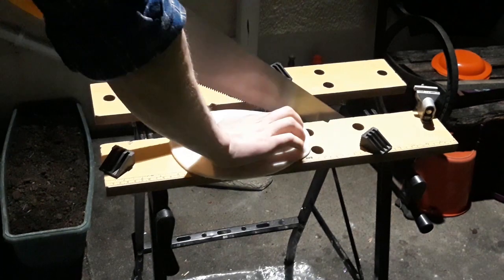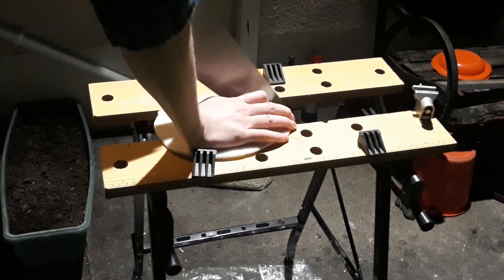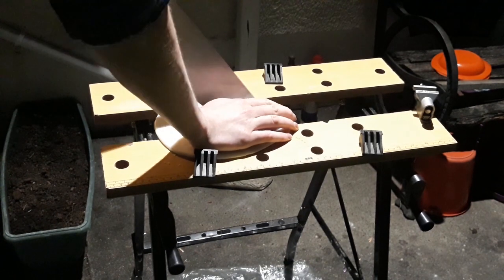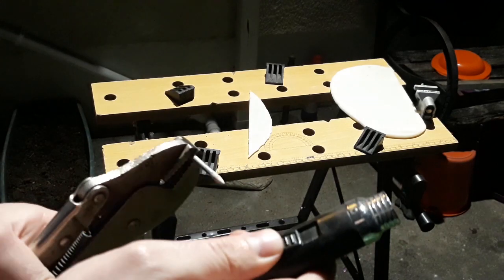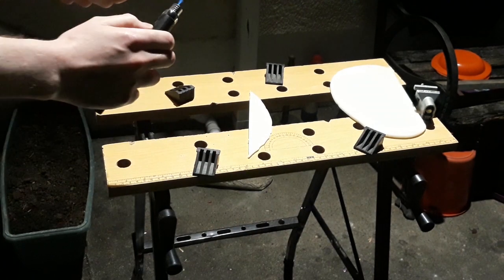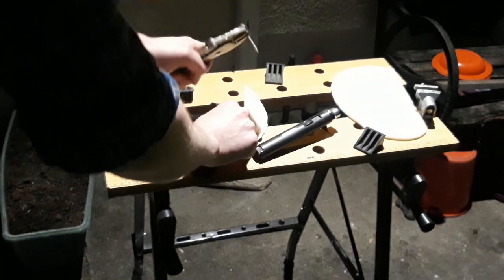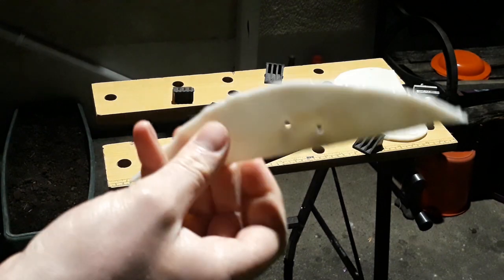For actually using high density polyethylene sheets, I found a saw for cutting wood works quite well. The trimmings can be melted again, so don't worry about losing material. Putting a sheet underneath the cutting table catches everything, so there's no waste. I found drill bits for drilling wood also work quite well, but for putting holes in it, I found it easier to heat up a nail with a torch and drive holes that way.